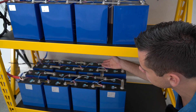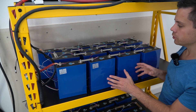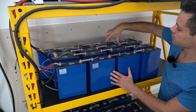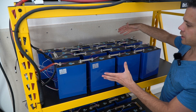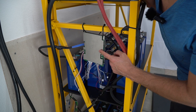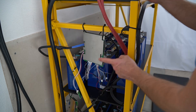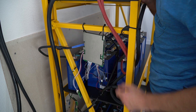This is a 48-volt battery with 16 cells in series. The second shelf is grade A brand new cells, but they're all different types of EVE cells. These terminals are very close together, and these are very far apart, so it was very hard for me to organize it on this shelf — that's why it doesn't look as nice as the other one. Some people will criticize how I have this BMS mounted, but it works great. If it ever were to fail, it's not touching anything and it's connected to metal. It has a lot of airflow, so it does look a little bad, but it's very functional.